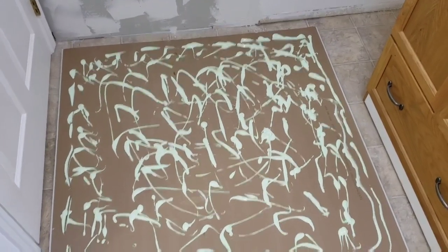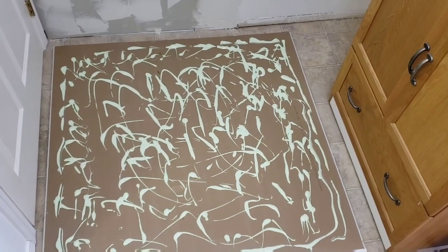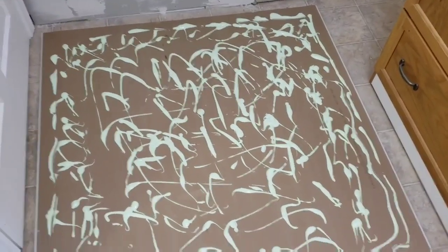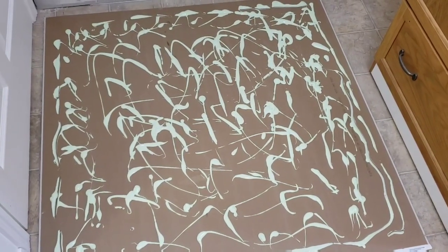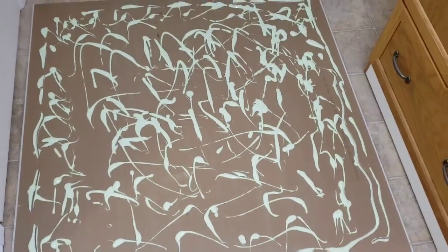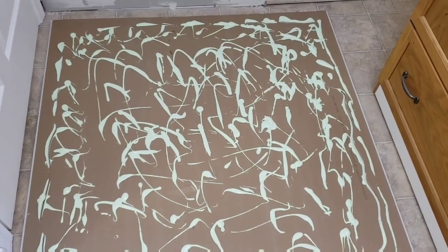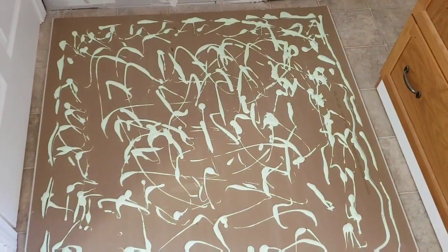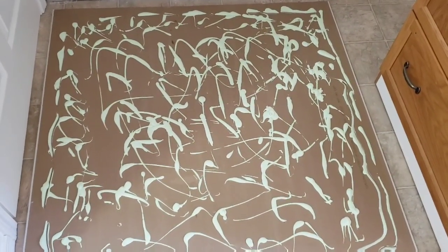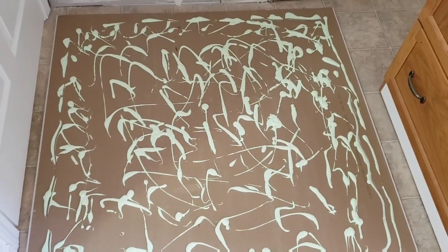Okay, so that's what a tube looks like on a half sheet. It's a really small room so it's hard to get the whole photo, but that's what it should look like. That simply traps the sound — they say it heats up the sound as it travels through the membrane of the drywall and stops it. I can testify that it works pretty well, but you should use five-eighths drywall. If you have any questions put them below. It really does work, but use five-eighths drywall if at all possible. Consider two sheets if you can — doubling up five-eighths sheets will make it very, very good.